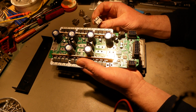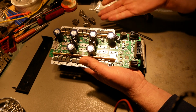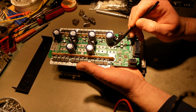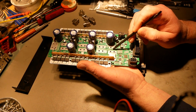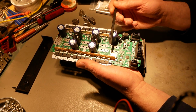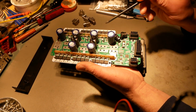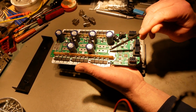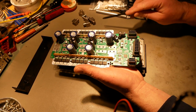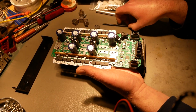And the inside of the standoffs, you can see that little cutout in them, and that's milled out. That's a machined part right there. And that is to allow you to bridge, yeah, you can see them. So right there's a bunch of circuit traces, and that's all of the gate control signals coming out of the CPU going to all the low side and all the high side MOSFETs. So they hid that in between there. This is all battery minus across here, but this is not your only way to get battery minus from this side to this side. There's more on the bottom side, which you'll see after a while.